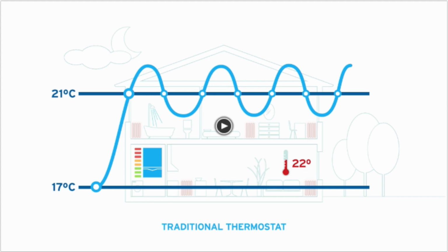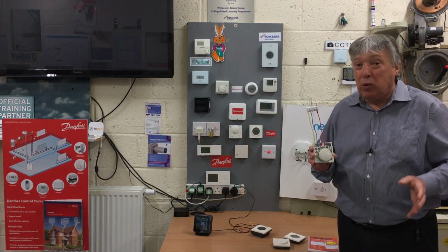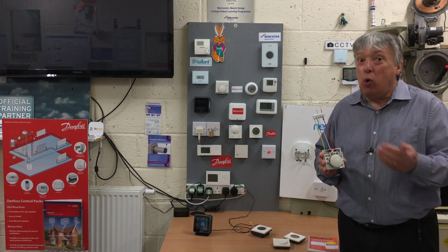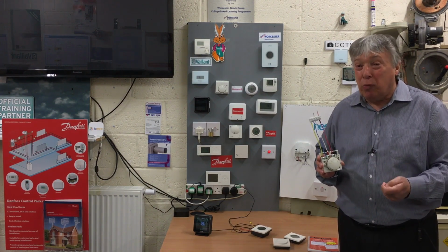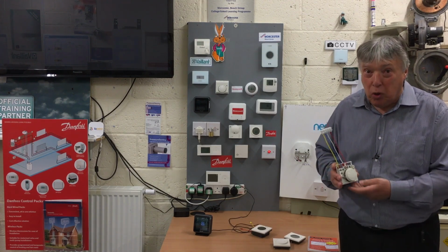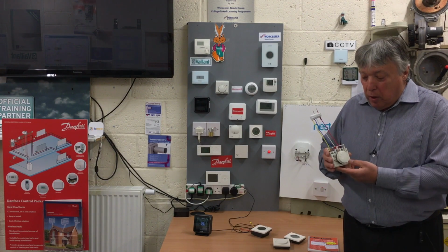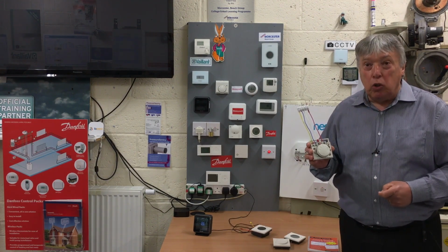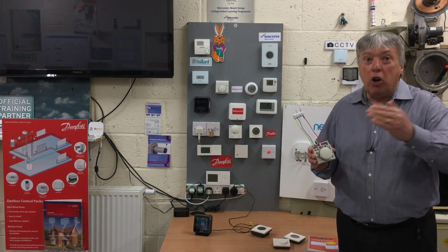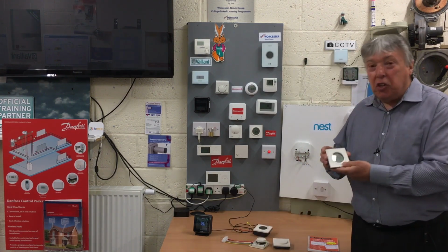And we've got some thermostats that aren't that old, not just from Honeywell, but from all different makes, and they switch off at 24. So you're paying for 4 degrees. Every time it switches on, it goes over, and then finally it switches off. If you don't put a live and neutral in these, this boiler becomes manual. So you'll have the house going very hot and then very cold. Very hot, very cold. So therefore, just convert it to digital.